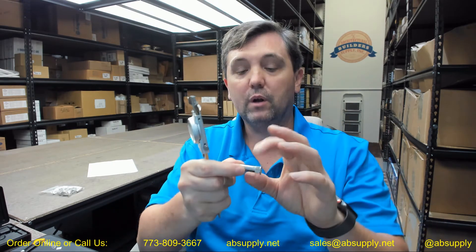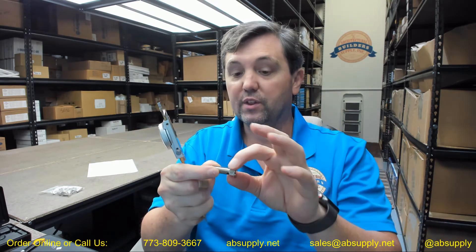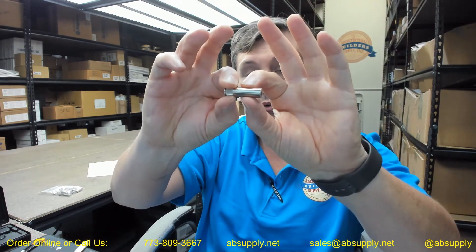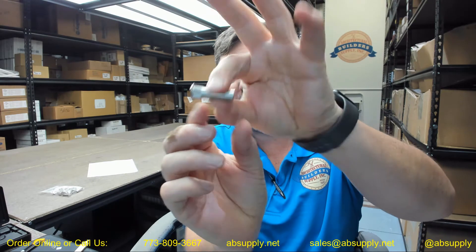The reason is that when you drill a hole through the door, the body of this is .374 inches, so you're going to drill a three eighths hole for it. The splines on here will prevent it from turning as you tighten the screw down — you don't want it spinning. The OD of the head on the opposite side is .53 inches, and it's inch and a quarter to the underside of the head.